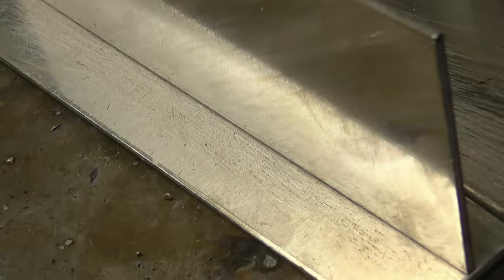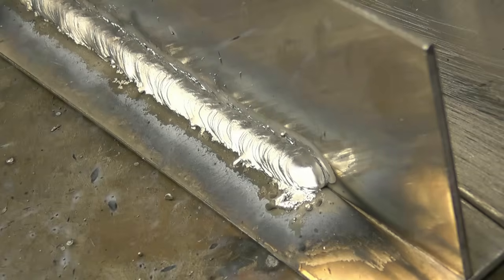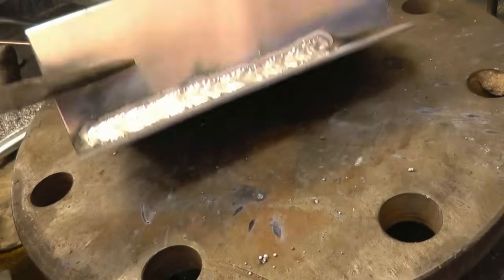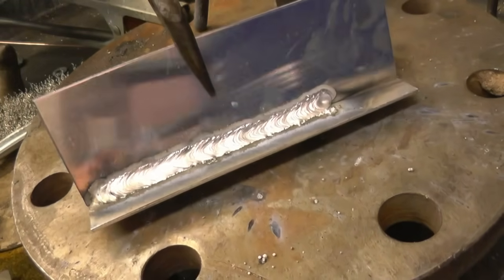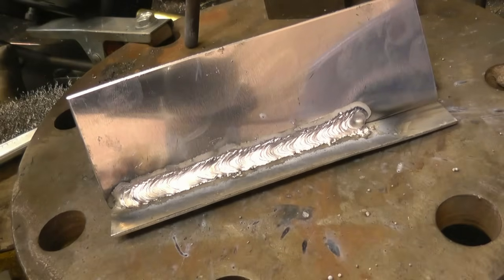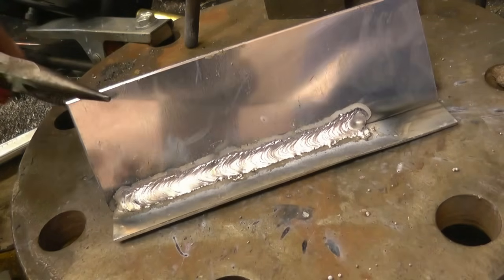That's quite a nice setting. These are the same settings and I've got a T-joint set up in the 2.2mm aluminium. I must admit I was quite impressed with that — the speed at which it welds is absolutely amazing. It's penetrating all the way through and there's hardly any soot at all on that weld. That is a real good setting for a T-joint. I think I'm basically now at the limit of what the 0.8mm wire will do, so I'll put the 1mm wire in to get some more power out of it and go onto some thicker material.